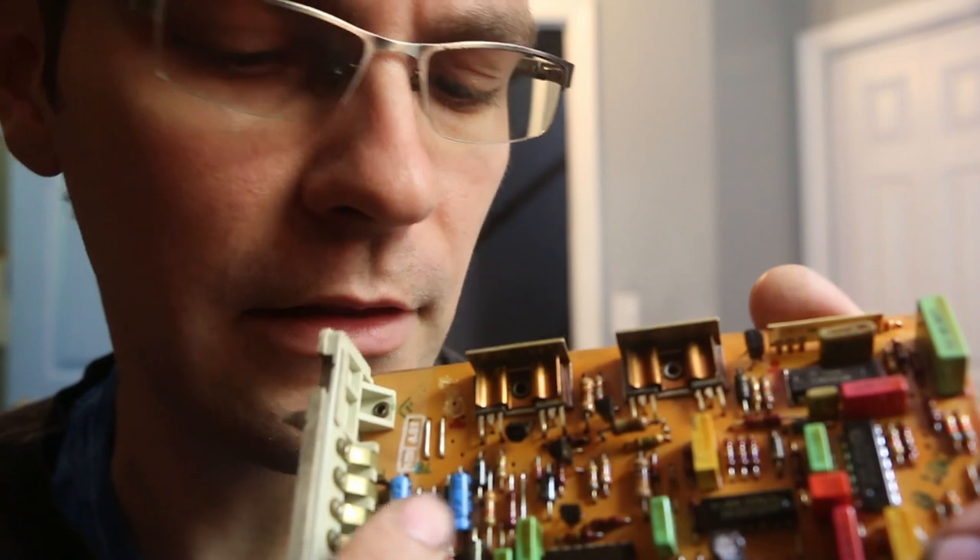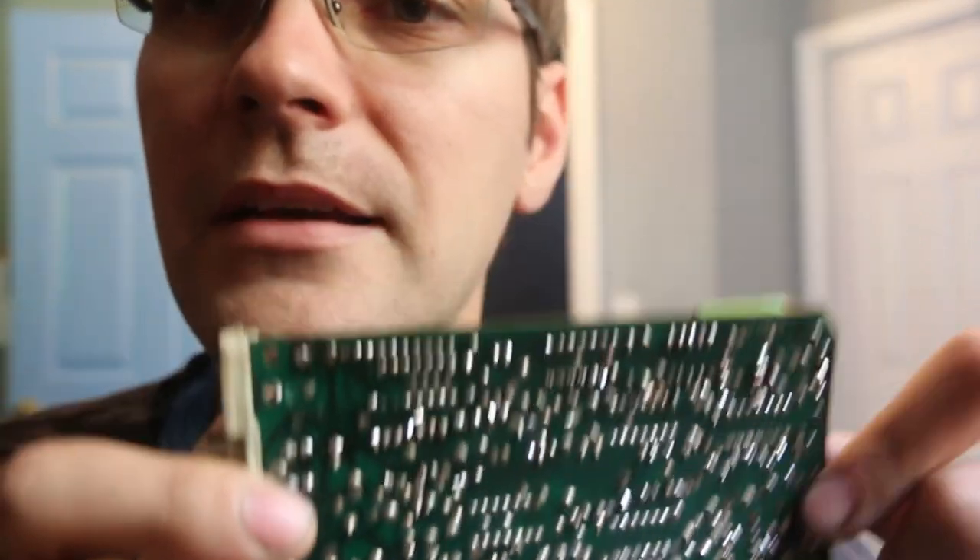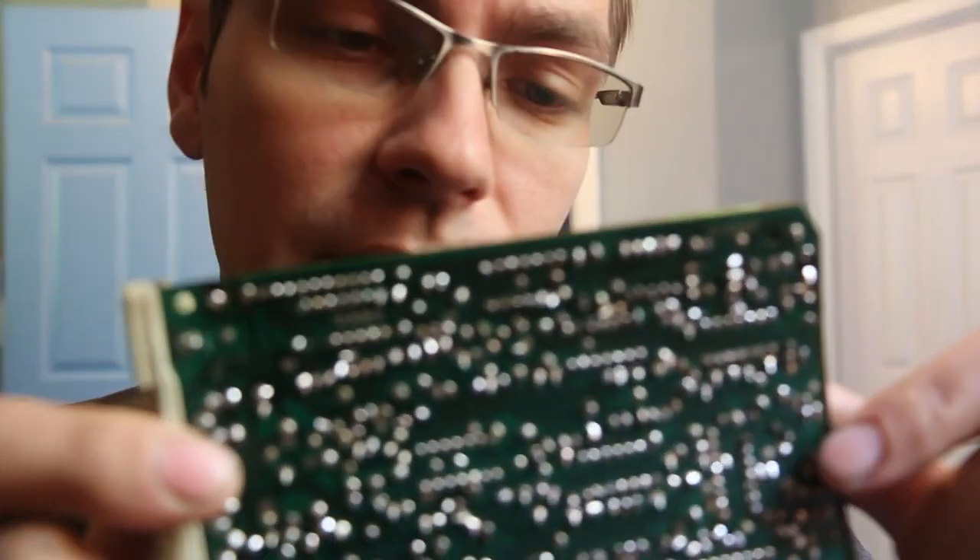But I replaced these five capacitors as we did in the video, and I reflowed the back of the board. Now, I am not a soldering wizard by any means — if you were to examine this with any scrutiny, you would see that it is incredibly ugly. But I reflowed the solder joints with my soldering iron, made sure there was enough solder on there for a good connection, and this amp works just as good as the one I did the first time. So without a doubt — replace those capacitors, reflow the solder joints, and assuming there's no other damage like burnt components, you should have a fully functional cruise control in whatever vehicle it's in.